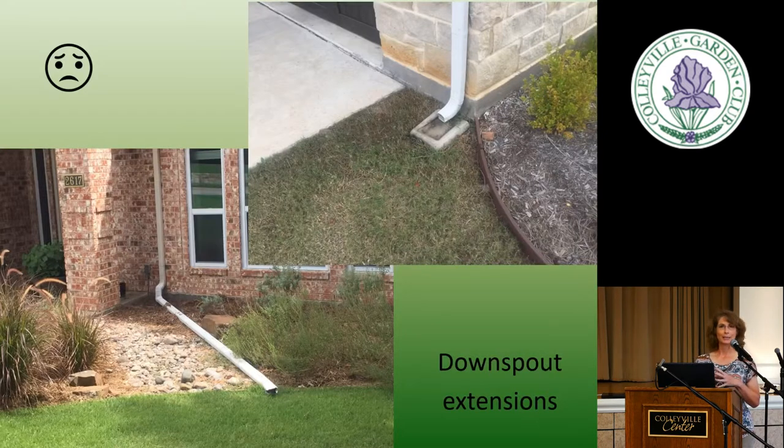Downspout extensions, something I don't really love. And this picture on the left-hand side, it looks like they have a little creek bed, but then they put the downspout extension beside the creek bed, so that doesn't really make a lot of sense to me. But in the right side picture, what I would do is put a different elbow on that, turn it toward the driveway, and then put the edging all the way to the driveway, and then I would put cobblestone in there, so when the water comes down from the downspout, it would hit the cobblestone and go out to the driveway.